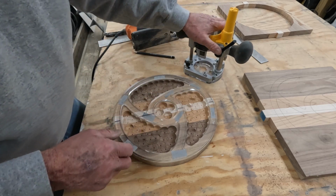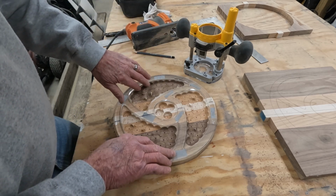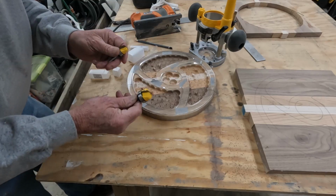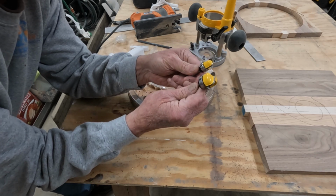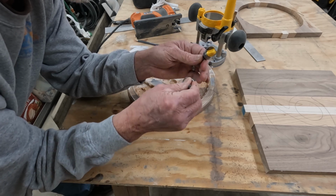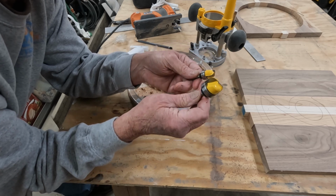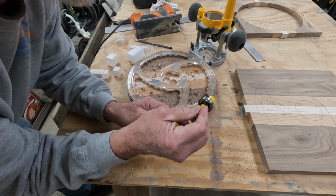I'm going to get my router in it, and we're going to be using a bowl bit. I'll show you that here in a second. So technically these are round nose bits or bowl bits. I ordered 3 of them from Amazon. I'll put a link down in the description for these, and these are what they call top bearing bits. And this bearing is going to ride on this template so that we can get this exact shape.